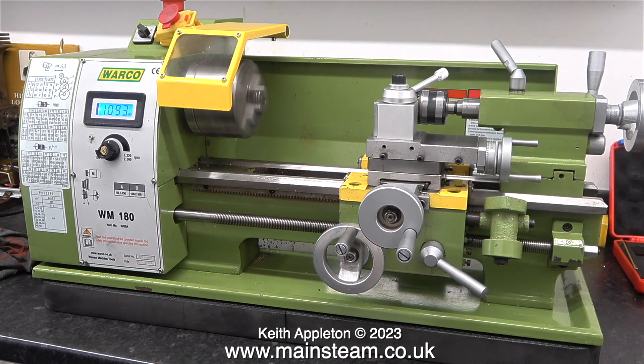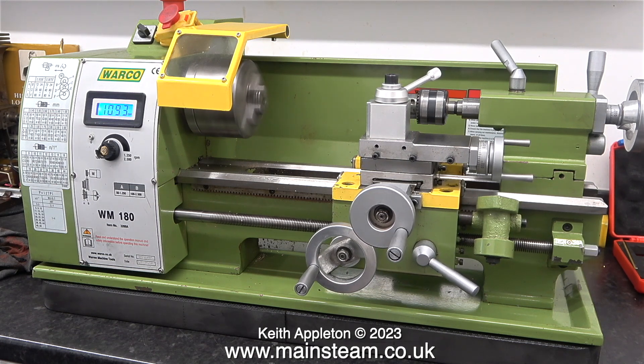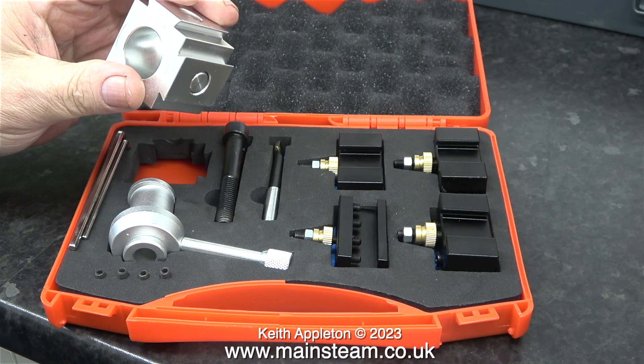As per usual, I have received quite a lot of comments saying: is the lathe not bolted down? How can it possibly work sitting on foam pads? I don't answer most of these questions — it's obvious it's sitting on foam pads, I made a video about it. These foam pads are very heavy duty garden kneeling pads. Not only do they damp down the sound and resonance of the lathe, they remove the necessity for leveling — they are auto-leveling.